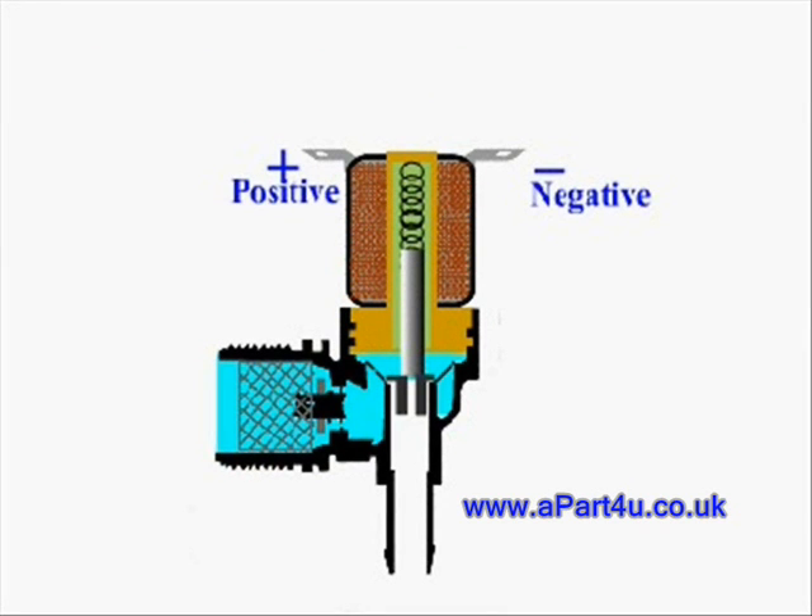The diaphragm is clamped between the valve body and the piston housing, which is inside an electrical coil. The piston is covering a small hole in the centre of the diaphragm, and when an electric charge is passed through the coil it magnetises the piston and lifts it up. This uncovers the hole in the diaphragm and the water held captive can now run free. The pressure of the water entering the valve will now force the diaphragm up and allow it to flow through.